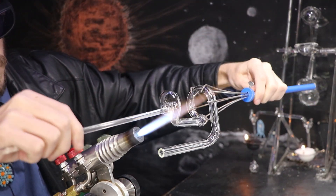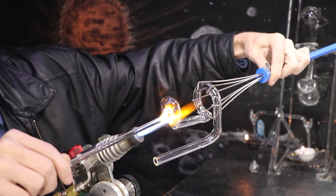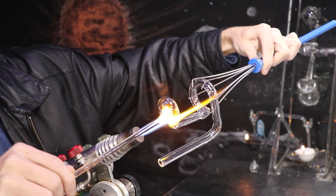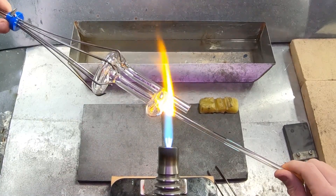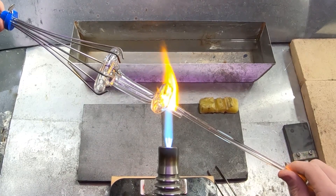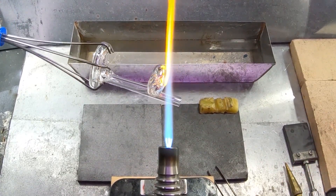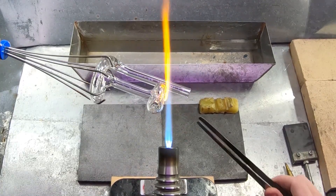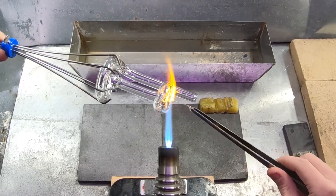As I reintroduce it into the flame, I hear a small crack. I don't see a crack, so I have to assume there's one there — most likely where the flame was last, here at the top. To be safe, I'll reheat most of the top ring again, so if there is a crack, it'll melt itself out. I just need to be careful not to overdo it and collapse the chamber.